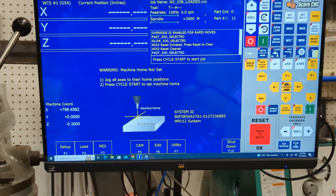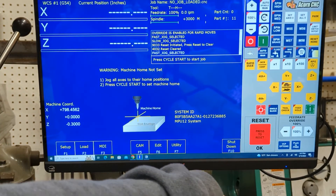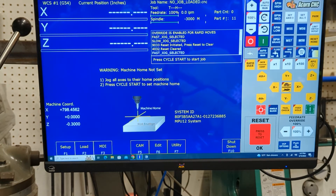If I turn everything on and put it in forward, my spindle's running. With the VFD I can go directly from spindle running forward to spindle running backwards — the VFD shuts the power down in one direction, the blade comes to a stop, then flips it in the other direction. The software also has a drilling and tapping feature that allows it to go down in the forward direction and come back out in reverse, which is a pretty cool feature.